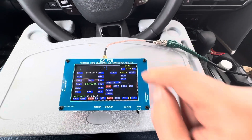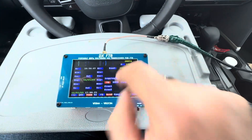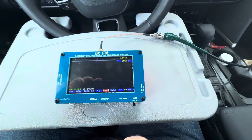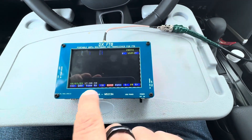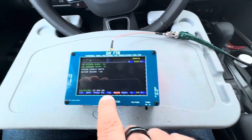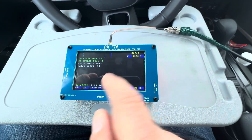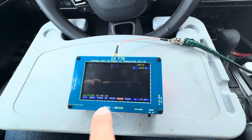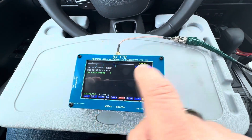You can also change the center frequency left and right with F-plus and F-minus. On the tune screen, RX is not a button — it's just an indicator. When the rig is receiving, it shows RX; when transmitting, it turns red and shows TX. There is also a mode indicator that shows you the current mode. For example, if we go to tune and choose SOTA, when we come back it shows SOTA — meaning that if we transmit now, it will be CQ SOTA callsign.